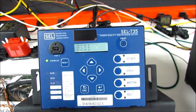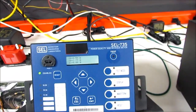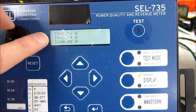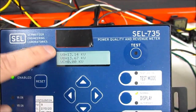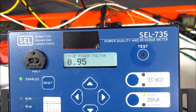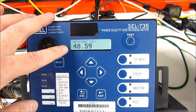This is a device that's actually used in the power industry. This is an SEL — Schweitzer Engineering Laboratory — power quality and revenue meter. We're using that to show the actual currents in use by the train system. Up here is the current currently in use by the engine, followed by the engine track voltage and the voltage for the town. We could charge both the train and the town based upon their energy usage monitored here.